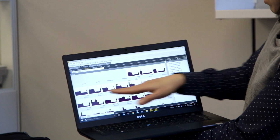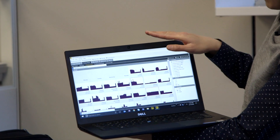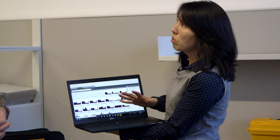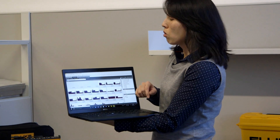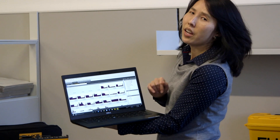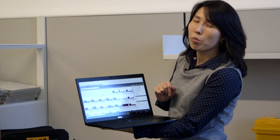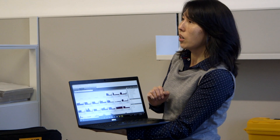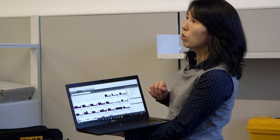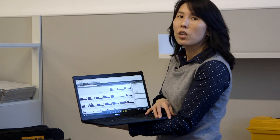In the energy study tab, you can take a look at the calendar view. It's essentially a week view — Monday through Sunday — and it's a nice snapshot to tell you what the rhythm of your plant or power distribution is doing. For example, here on a Saturday, if this facility is supposed to be shut down and we're not producing any product, why is power being used at a high level? Maybe the AC is running and nobody's there — we should be minimizing AC or heating usage.